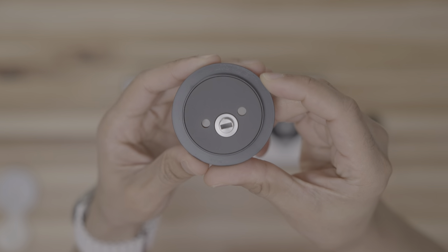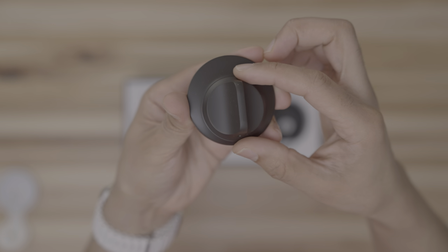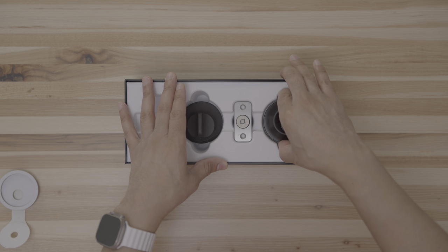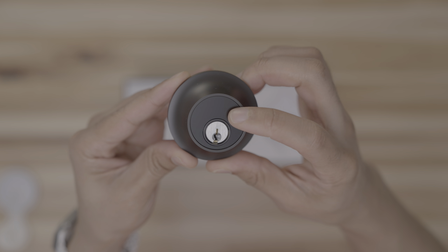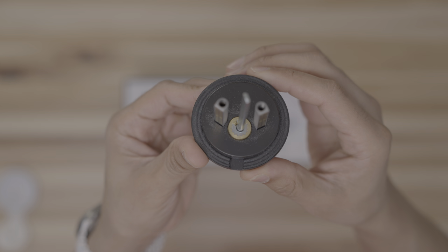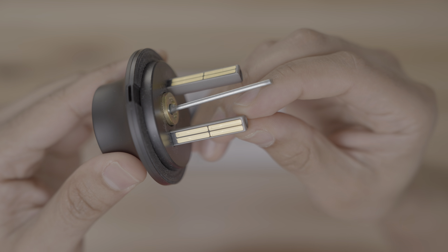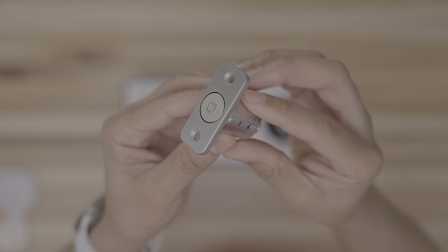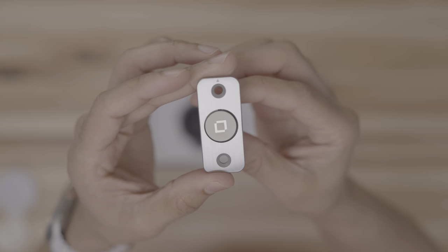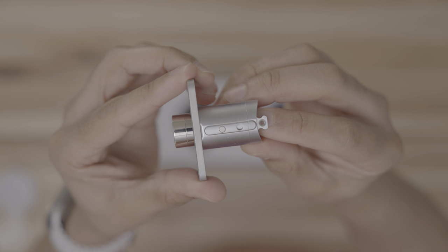This piece here bolts into the key housing, and then your magnetic paddle goes on top. Here is the key housing — it's NFC-enabled for Apple Home Key support, which is important. The key housing has the tailpiece and the smart connectors with pins. Finally, you have the deadbolt itself, which is capable of extending where necessary, and it connects directly to the motor and houses the CR2 battery.